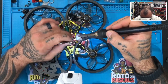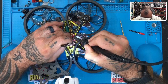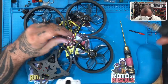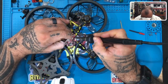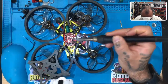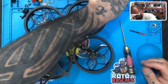Let me get my glasses and get started. So there's our signal plus, the red one is going to be our five volt, and then the black one is our ground. What temperature is your iron at right now? It's at 400 Celsius.